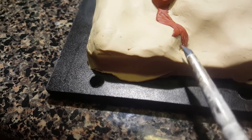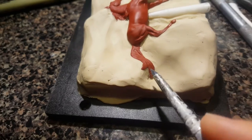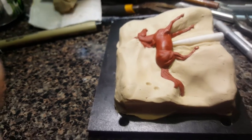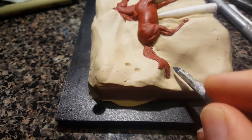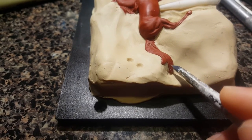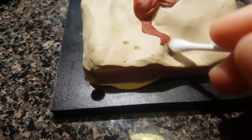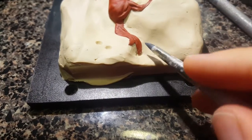It's not quite as important for it to be perfectly clean and smooth away from the horse, especially because after I have it all clean around the edges I'm going to go back in and make little dimples that will fit the two sides together so everything stays aligned perfectly and can't get misaligned. Another thing I'll do if I get some clay on the area away from the very edges — I'll just take a q-tip and wipe it down so it's nice and clean.